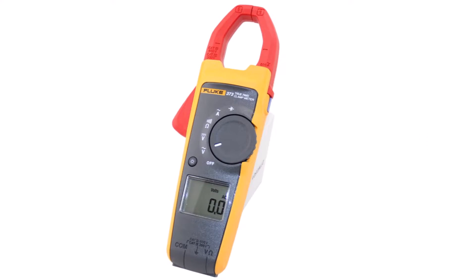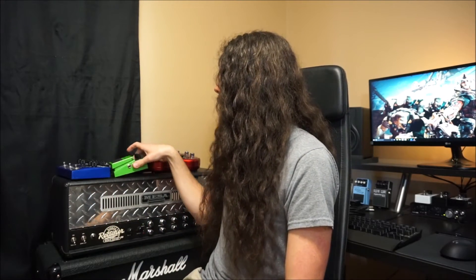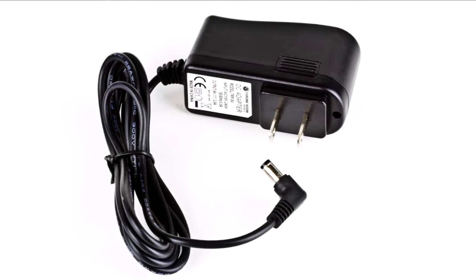The third important specification is current draw, or amp draw. This One Spot can output up to 1700 milliamps — 1700 thousandths of an amp. When we're talking about small electronics like this, one amp is actually a pretty big unit, so it makes sense to divide it up. For stomp boxes generally you can estimate between a 200 to 300 milliamp draw. A lot of times they will over-spec it on purpose so you can daisy chain more than you might think if you do the straight math. One of my pedals, the Moore Ocean Machine, is actually rated at 500 milliamps, and I kind of believe it based on my experience.